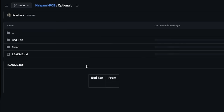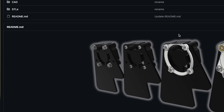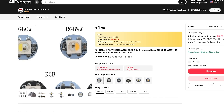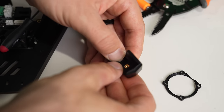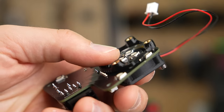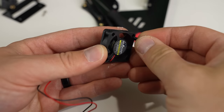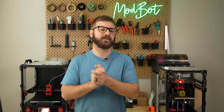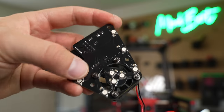There's an optional folder containing files for the front bed cover with an LED diffuser and lid, as well as bed fan mounting options. I printed the front parts and discovered they were intended for someone using a WS2812 NeoPixel in the same form factor as the ones in the stealth burner. Since I was using a larger PCB with a JST connector, I had to print a different front plate and diffuser, which I found in the supplemental print guide for the LDO V0.2 S1 kit. I tried all three fan mounting options and none of them worked — the first two bumped into the LEDs, and even the peg-style mount didn't fit. The project creator confirmed those mounts were designed for the V1 variant before LEDs were added to the PCB. I ended up using M3 nuts, which worked really well, and that's what I recommend until there's an update to support the V2 board.